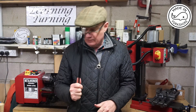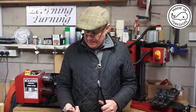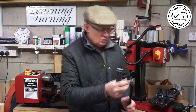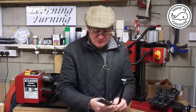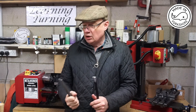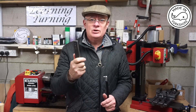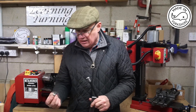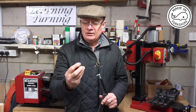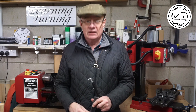There are two other items that you need apart from the gas strut. One is a piece of mild steel bar or aluminium, which is used to create the bracket that will hold the top piece of the gas strut — the bracket will fit on here. My bracket is based on a design I saw on YouTube on a channel called Sinkhole40. The other item you need is an M10 bolt with a 25mm thread, which should be sufficient. So let's see how we get on.